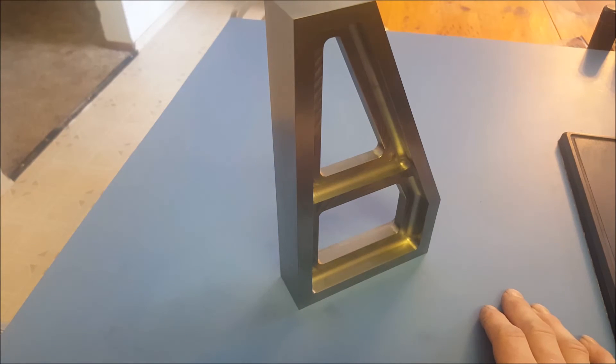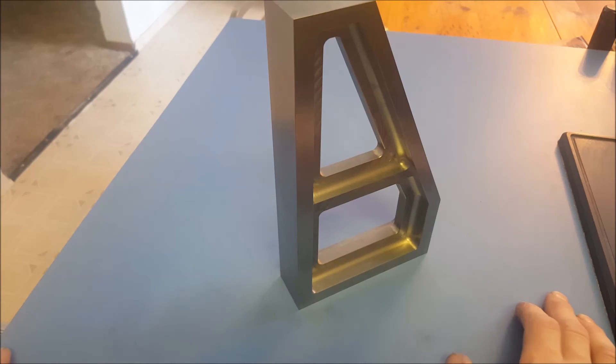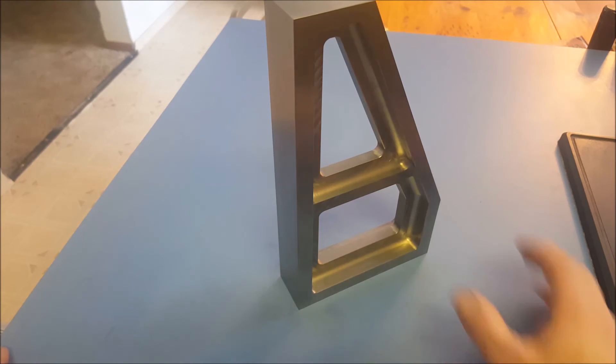I've had success with it with this same exact material before, scraping in a dovetail straight edge. It would move a little bit and I stuck it in an electric oven, clean cycle — it usually takes about five hours. The temperature supposedly can reach 932 degrees, it's enough to turn whatever's inside the oven to ash. It seemed to work okay on the last run, kind of a smaller part but the cross section similar in size to this.